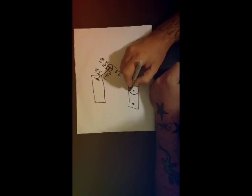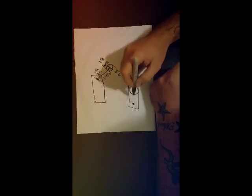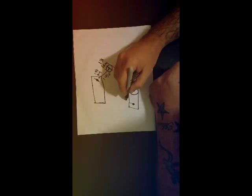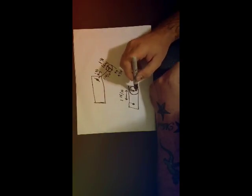You get better penetration there. So what I'm going to use is a 1 1/4 hole saw. So I need to know the center because the hole saw has a pilot bit. It's 1/4 inch, doesn't matter. But basically I've got to make my pilot holes 1 15/16 apart from each other. Once I do that, then I can drill this larger hole for the tube with a 1 1/4 hole saw.